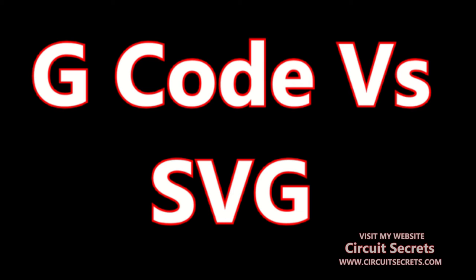G-code is the industry standard for most machines, but SVG is an alternative used mostly for things like vinyl cutting machines. SVG stands for scalable vector graphics — SVG files can be resized with no loss of detail and are great for images. However, SVG files have no special machine commands and are not really expandable. G-code supports many machine commands and new commands can be added to a machine's G-code interpreter to expand functionality. Most CNC machines found online that use DC motors and feedback control are built to use SVG files as they require less processing.